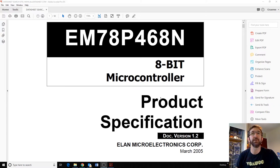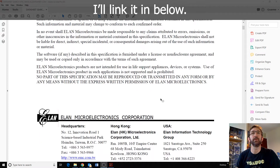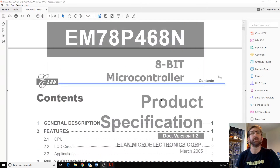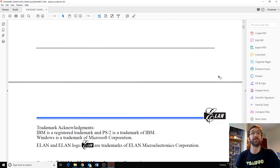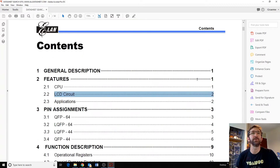After a quick Google I found the datasheet for this processor. It's an Elan Microelectronics Core processor — the EM78P468N 8-bit microprocessor. I'm not expecting anything more than an 8-bit processor for this; it just has a few LCD segments to manage, a bit of timekeeping, and a few timer triggers. It's a pretty simple circuit and software. It's a no-brainer why this processor was chosen: it has a built-in LCD driver circuit. You don't want external circuitry to manage that — you have a small amount of space inside the clock, and for something as simple as this, a built-in driver makes a lot of sense.